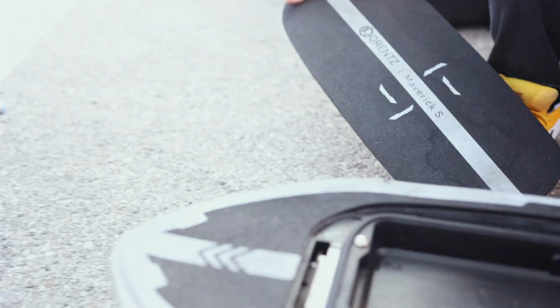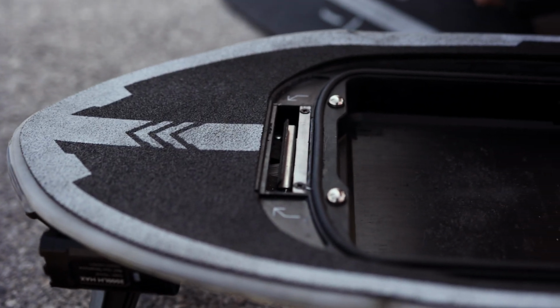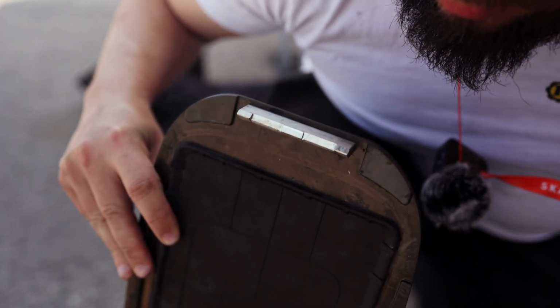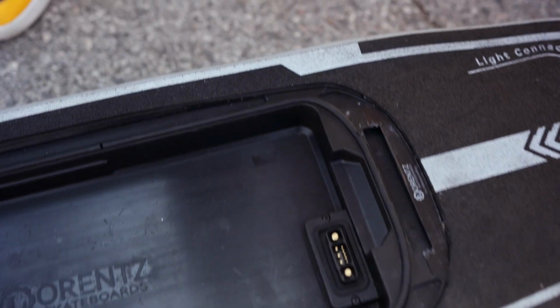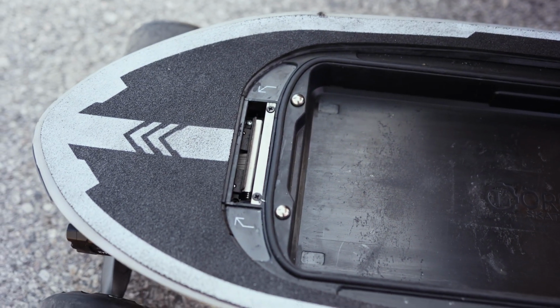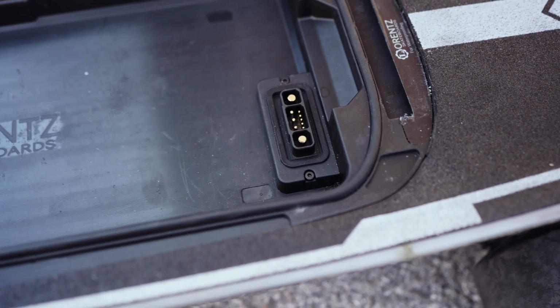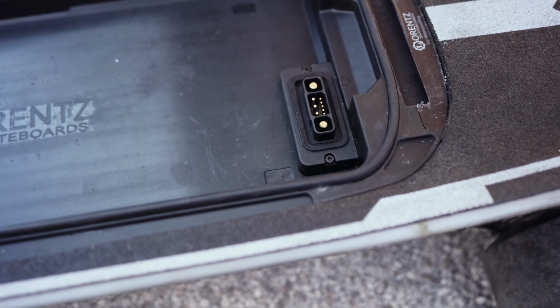It's pretty cool. In the front here, you've got a little piece of bent sheet metal that interfaces with a clip on the front of the lid, which is going to be right here. So it latches into that, and then on the aft side, you have a slot. We've got a slot back here that the lid fits into, and then you've got a gasket. It goes all the way around the outside for water resistance.